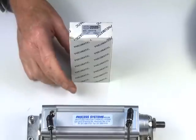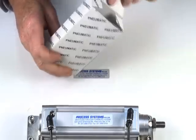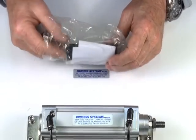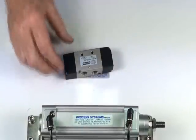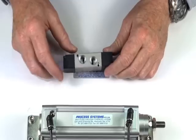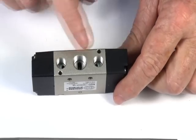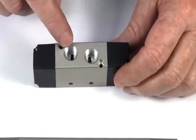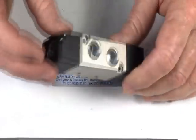This is a five-way double pilot valve. It's available at one-eighth, quarter, three-eighth, and half inch BSP. We have an inlet supply here — in this particular case it's quarter BSP. The exhaust ports in this one are one-eighth BSP with two outlets, the two pilot outlets both in quarter and two one-eighth BSP pilot ends.